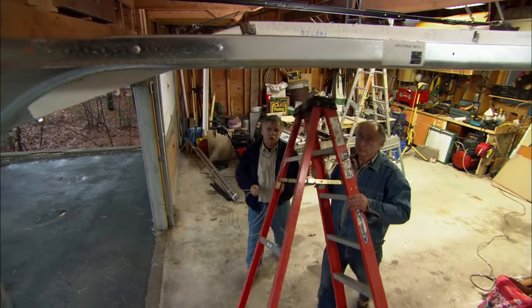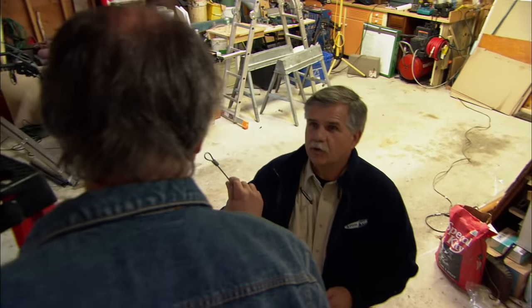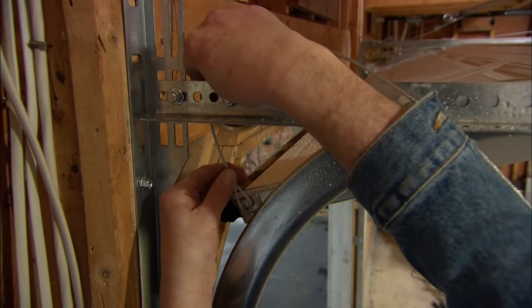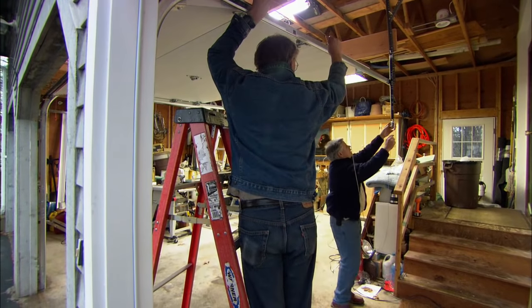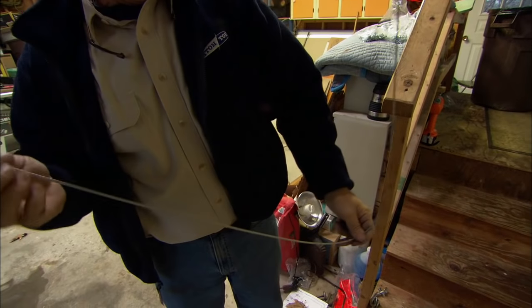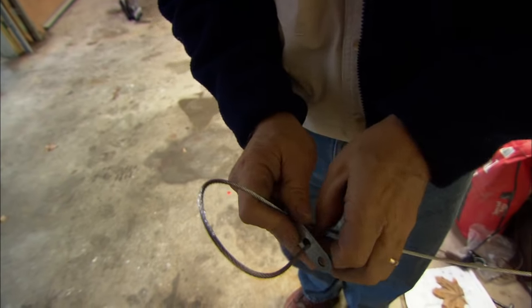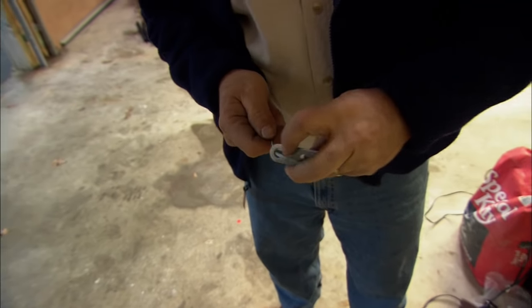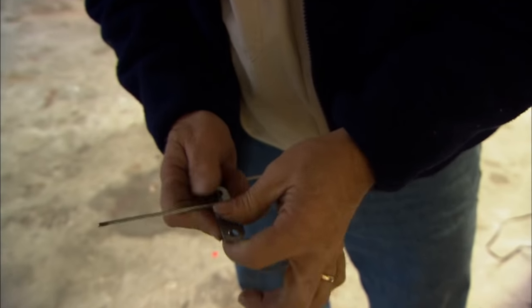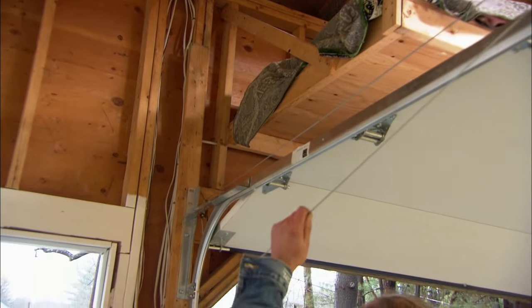With our door up we now have access to the bottom panel — that's the bracket on the bottom corner where we will attach the cable. The cable gets attached to that bottom bracket and goes up over the pulley. Now I'm going to take my end of the cable and put it through the pulley on the spring, tighten it up a little, then put the end of the cable through this little bracket — down through this way. Take a little bit of slack up, put it through that loop. Now I'll take an S-hook, hook it on the bracket, and install the S-hook to the track.